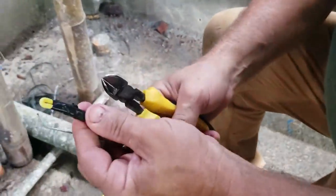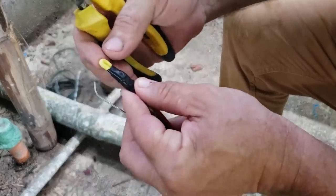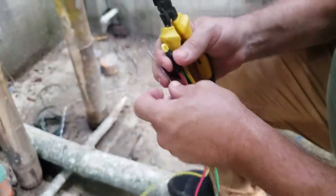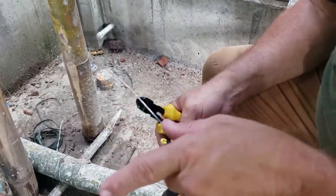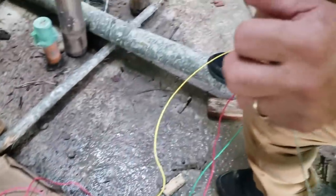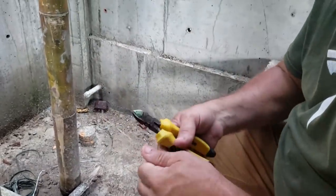So we're gonna pull our wires here. I got them taped together here. One of them looped back that I'll hook this wire into after we finish it. And we're just using these rolls of tie wire. Show them right there, Mike. That's our fish tape. That's what we're using here for fish tape. It works great, doesn't it? Yes, sir. Yeah, it's commonly used.